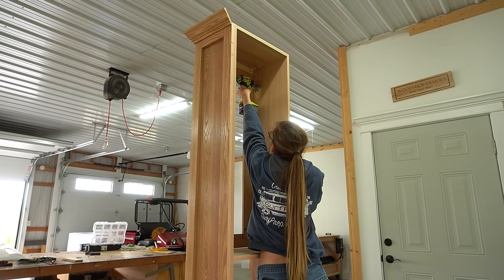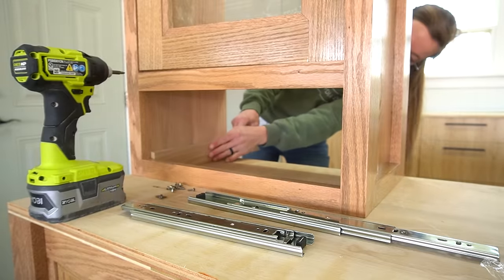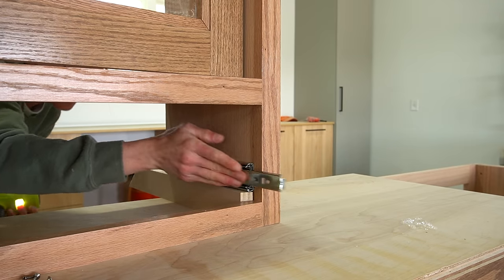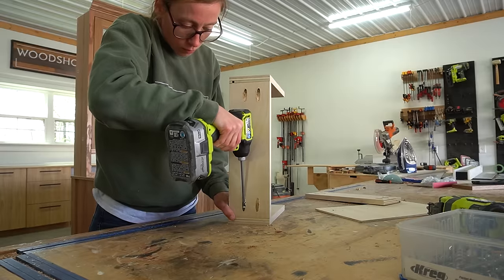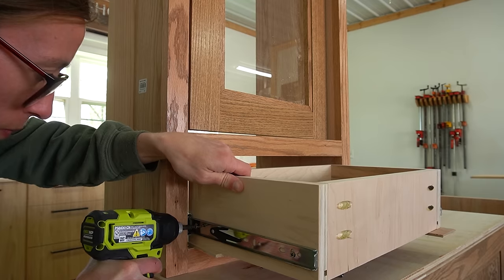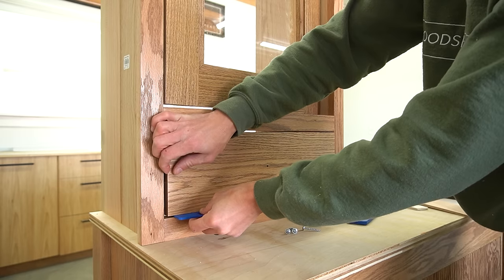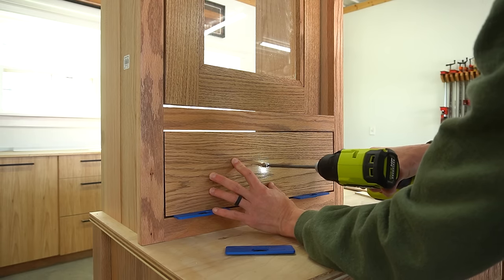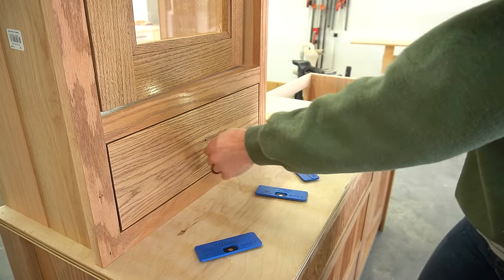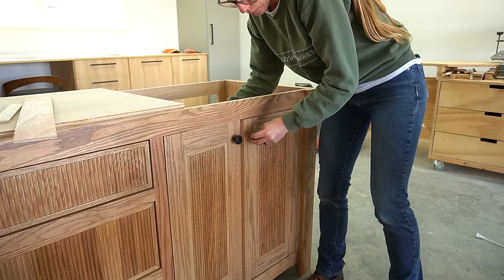With the door installed on the cabinet, all that remained was the small drawer for the bottom section. I installed 10 inch slides into the opening 3/4 inch inset from the front, then built a tiny drawer box to fit inside — possibly the smallest drawer I've ever made. I installed it onto the slides, then drilled a hole in the center of the 1x6 drawer front. Since attaching it in such a cramped space would be difficult, I screwed it on first, then opened the drawer and secured it from the inside. I reused the hole in the middle to attach the knob, then added knobs to all the doors and drawers.